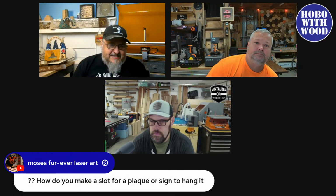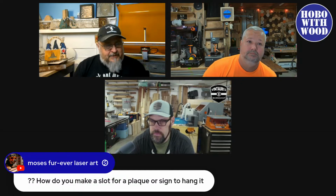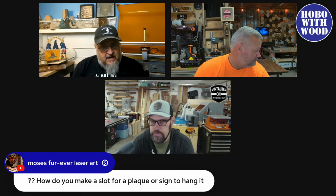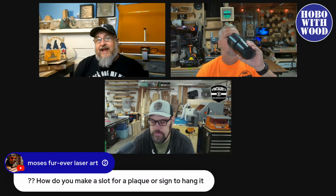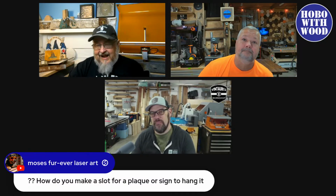Moses, how do you make a slot for a plaque or a sign to hang it? Moses, it depends on what you're referring to as a slot. If you mean an actual physical slot like I do for the plaques that I'm selling, I have a keyhole router bit that I will router a keyhole in the back of it so you can hang it, and I'll do a horizontal and a vertical so you can do landscape or portrait.